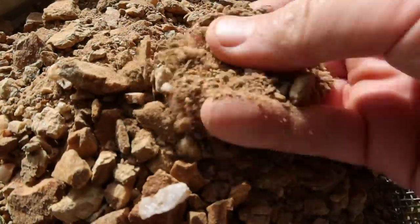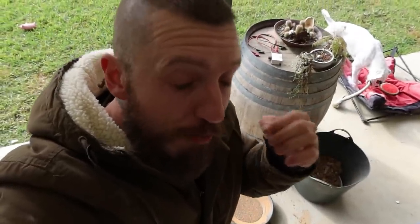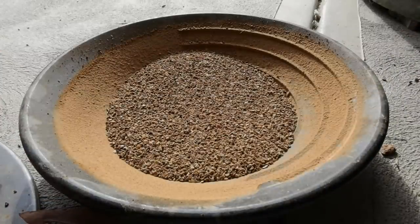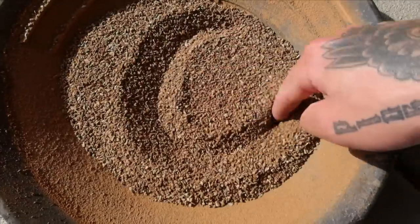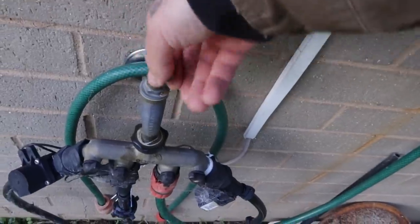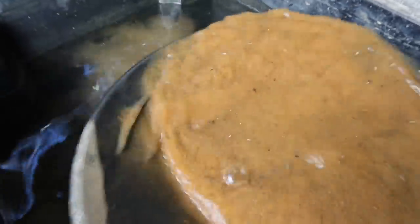One of the fastest ways to figure out if there is gold in the vein is to take your sample and classify it down to one-eighth inch mesh or below. When you chip the rock out of the face it creates dust - some of that dust is the quartz that may be containing gold, and it's already pre-crushed and ready to sample. This is all the dust I managed to get out of our sample, and this is going to tell us if there's any gold in that vein.